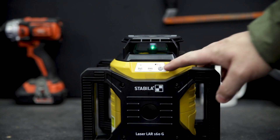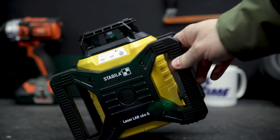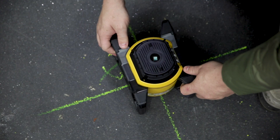It's also got auto and manual modes. Auto mode automatically levels the laser precisely every time, while in manual mode you can lock the laser and set it to whatever slope you need. It's also got a plumb line out the top and there are four indicators on all sides of the laser — line those up with your mark and the laser will indicate the same point above.